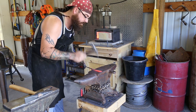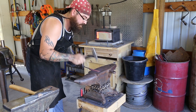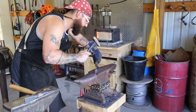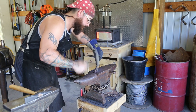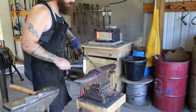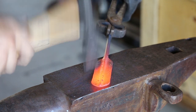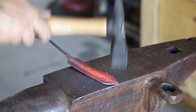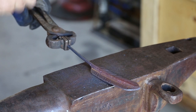I use a bunch of different hammers. You can see over on the left there's a tomahawk chipping hammer — that's got a cross and a vertical peen on both sides. Here I'm just using a small one-pound cross peen hammer, and basically I'm just going to put in the design with that. One of the videos I watched was absolutely beautiful — the gentleman used a cold chisel to put in the detail. This is just my particular way of doing it. Here you can see we took another heat. After I've gotten the bigger textures in from the one-pound, I'm using this sharpened tomahawk and really laying in some fine line detail.